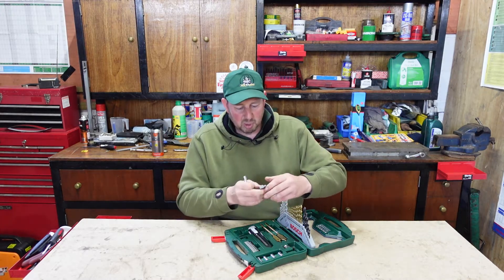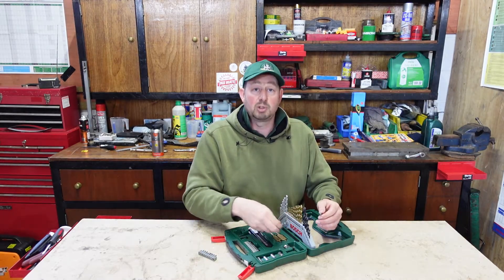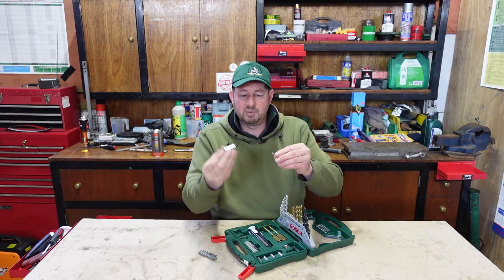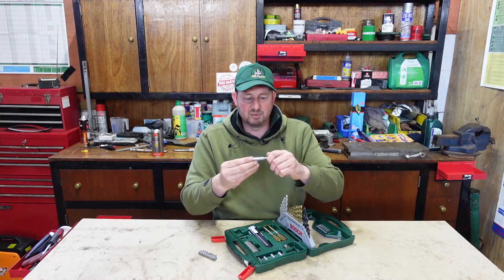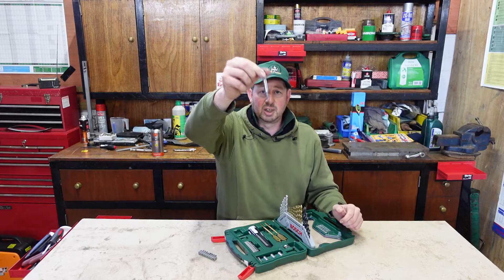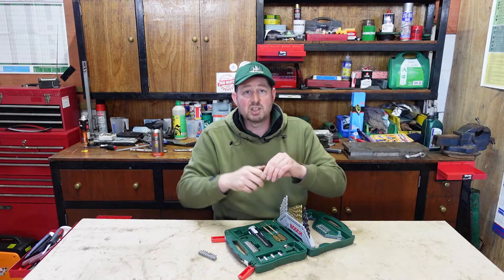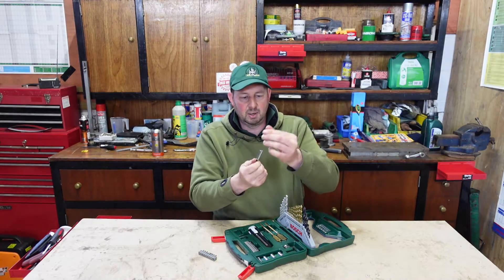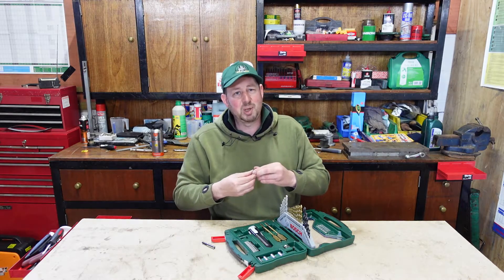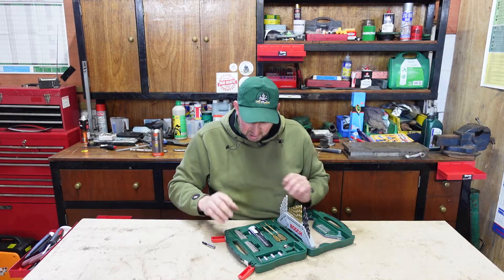To use those, you put them into the holder. There's the holder that goes into your drill or impact driver, and then the bit fits in on the end — it's magnetic, there's a little click and it's stuck in. With that stuck in, you can move your drill round whichever way you want and it's not going to fall out. As long as this is screwed up tight it'll hold the magnetic bit in. It's really handy because the amount of bits you've lost, and the time you spend scratching round on the floor trying to find them, takes forever.